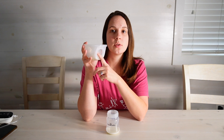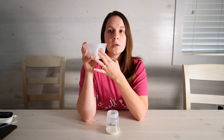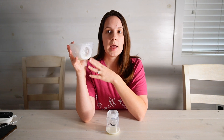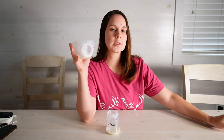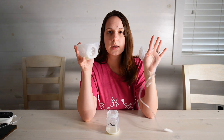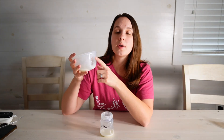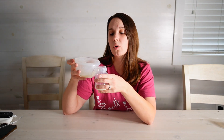Another issue we're seeing is milk being sucked up into this backflow area. If you have milk there, that's already a big red flag and we need to get some things addressed, because there's no backup to the backup. If you have milk there, it can very easily get sucked into this tube and then it sucks into the pump — and now that pump is dead. So if you see milk there, you're going to want to try and pour that out first before tipping it up and getting the rest of your milk.